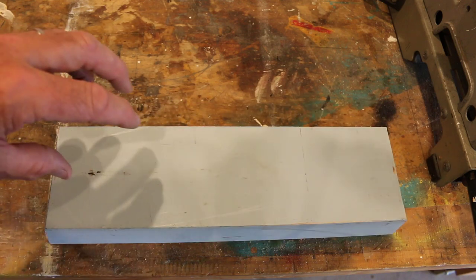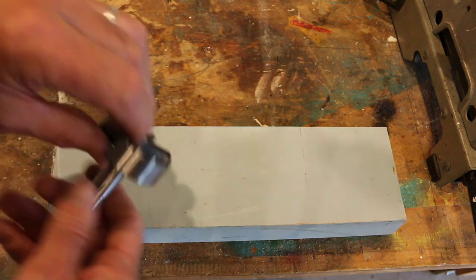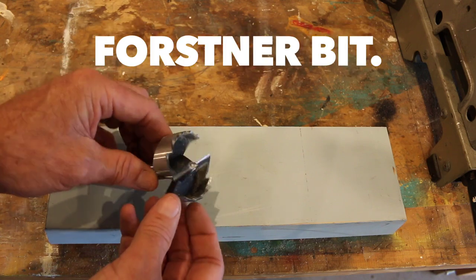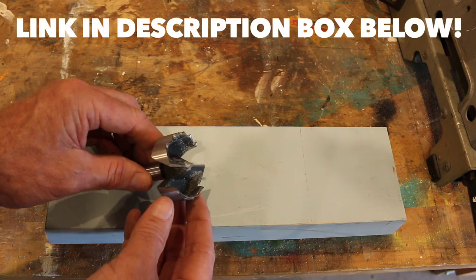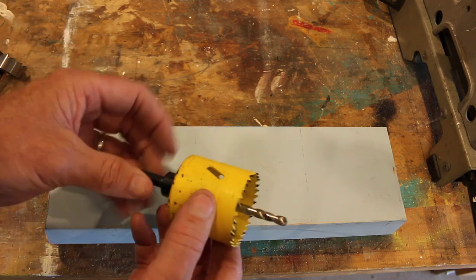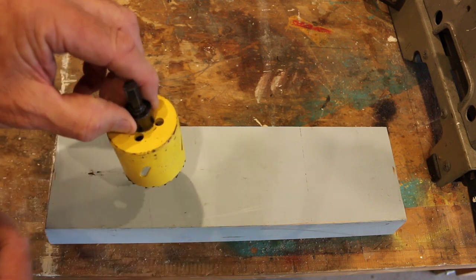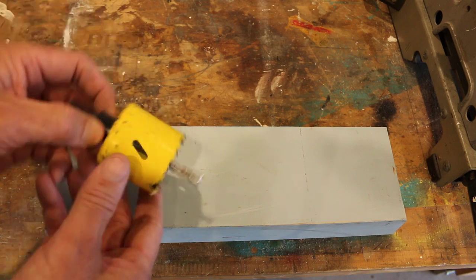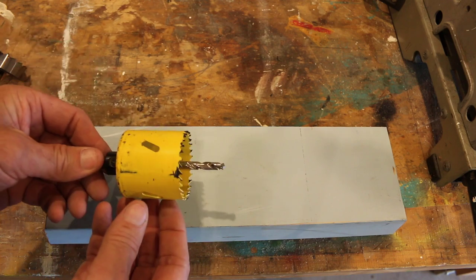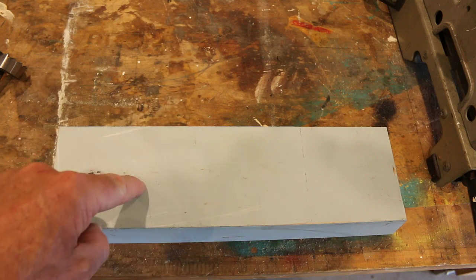Before we do anything else, we need to drill the holes for the actual cactus plants. For that I'm using one of these fancy bits — it's called a Forstner bit. I'll leave a link to it in the description box down below. If you haven't got one of these, you may have a hole saw in your toolkit — it's used for drilling out door handles. Drill into the wood down to the desired depth, and then you'll just need to chisel that wood out. Not quite as neat and a bit more time consuming, but it'll do the job.